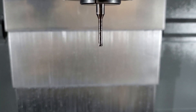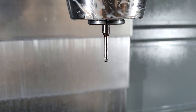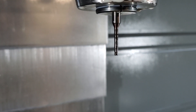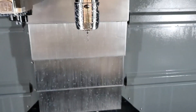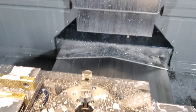Here is the tool I want to show you guys. It's a high-feed mill. A company called Mill Star makes them — they're made in the USA. You see there's no flutes up the shank; the shank is relieved. You just have these cutting flutes at the bottom. This tool is a 1/8th inch diameter and it does six times the depth of cut — a 3/4 inch depth of cut.